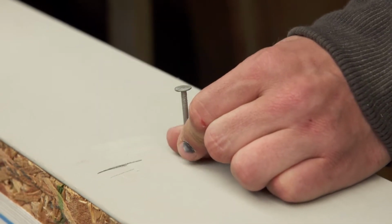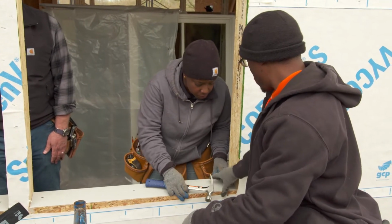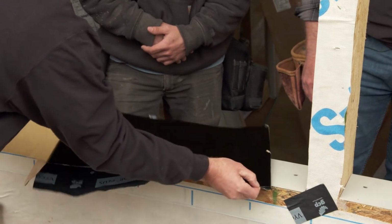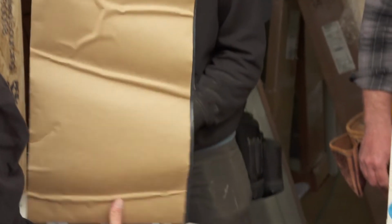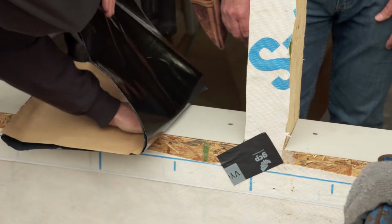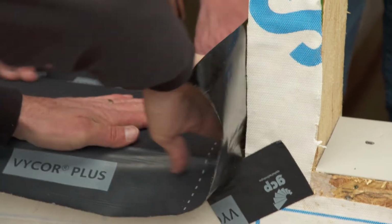All right, so we're just using regular roofing nails to fasten this clapboard to the sill. Okay, so now we have our pitch. So we want to waterproof this system so that the water that comes in will work its way out. We have a flashing tape here that we're going to put in, and this is self-adhered, so we're going to remove half the paper on one side. You don't want it to stick to itself. Pull that in there. Okay, we're going to go about halfway in. We'll start in the middle and work our way right to the outside, and then run it up the sides.